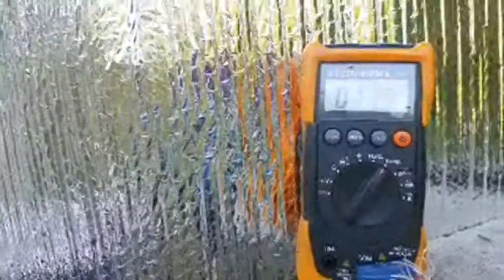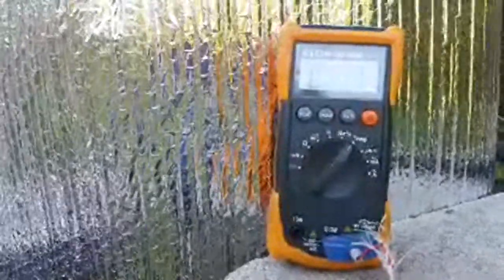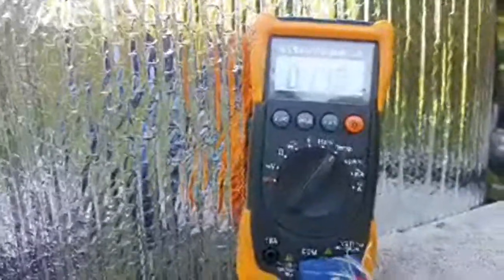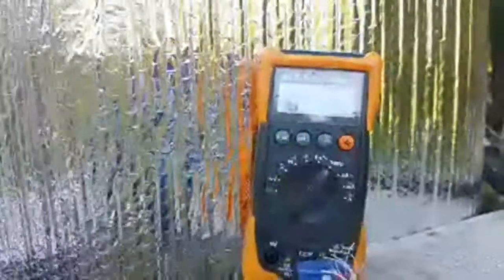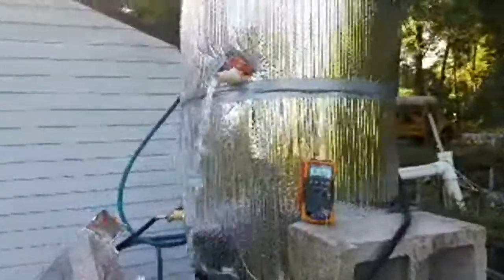Okay, so we're getting a drop now. It's dropping fairly quickly as more cold water comes in, and that's because the big float valve in there is dropping lower and opening up and letting more cold water go in, which is creating turbulence and leading to that mixing. But still super hot. 118, it just danced between 118 and 117. Now it kind of went up, now it kind of went down. And we're at the 12-minute mark, but not 12 minutes since I started flowing. So probably been going about 8 minutes of flow. It's gone up to 118.